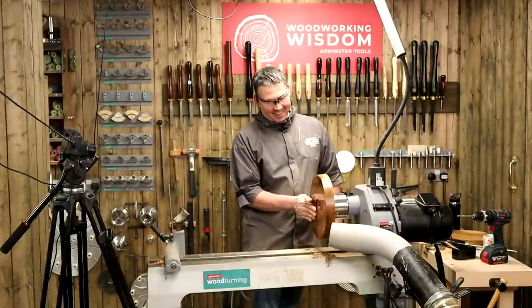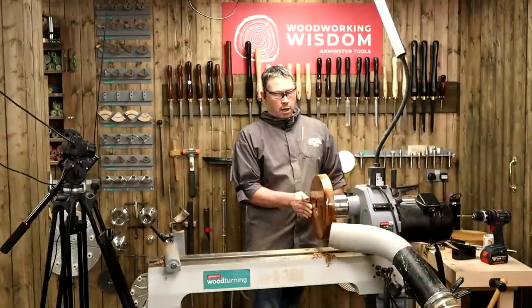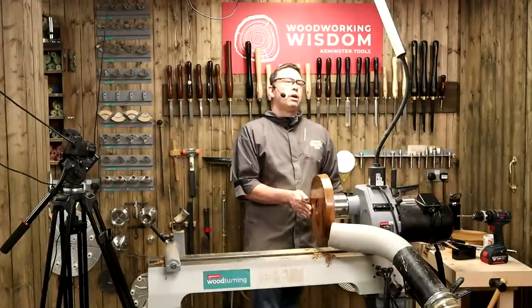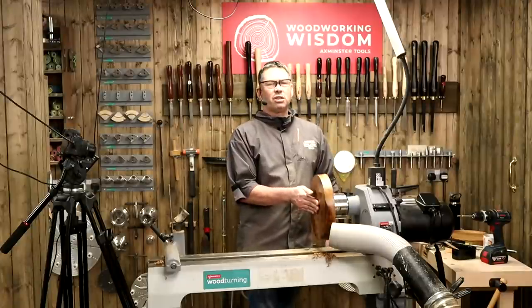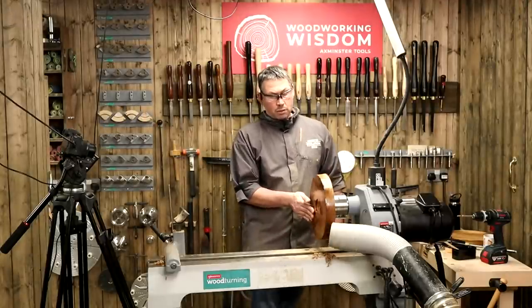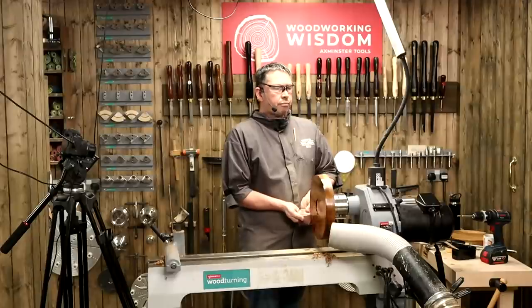So this is from Paul. Could you use Chestnut finishing oil over spirit stains on the ash timber? Finishing oil over spirit stains, yes. You could do. The trouble with it, you wouldn't be able to work that oil in. You would get residue. You would get the stain coming off when you do this sort of thing. So I'm sanding this oil in. And really, oil needs a little bit of work once you put it on. If you just leave oil, the grain and the nap rises. You do need to work it in a little bit.